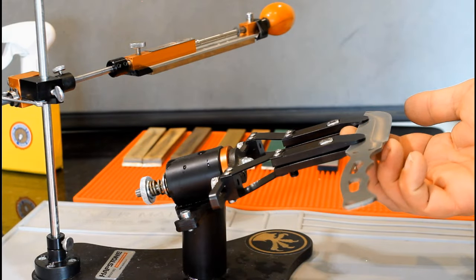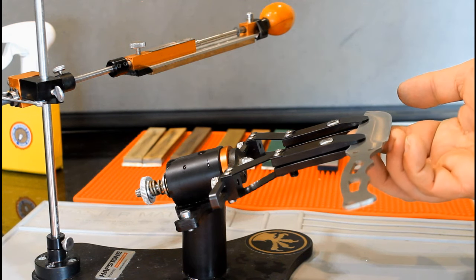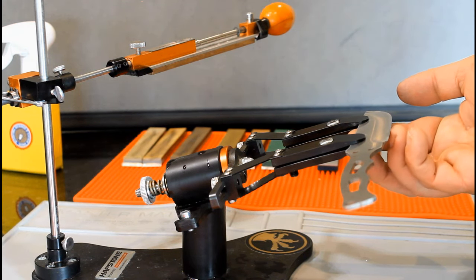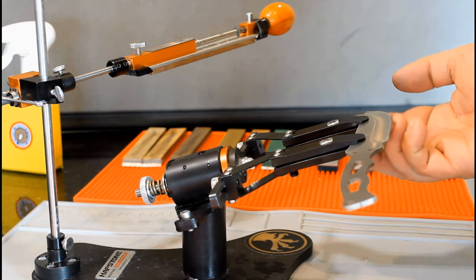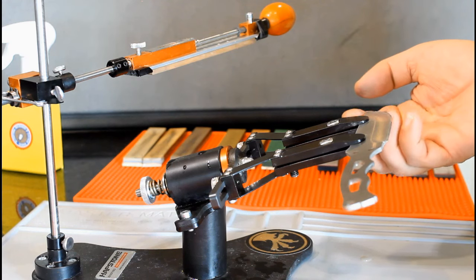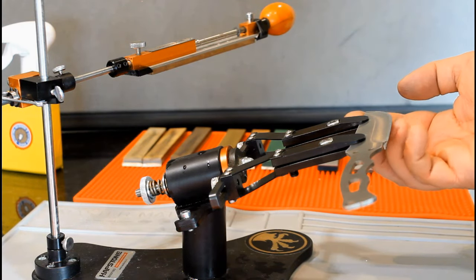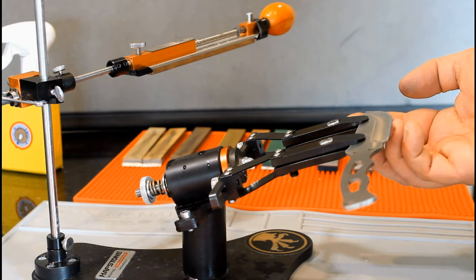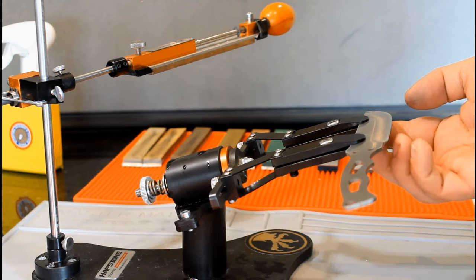All right, the burr is faint in the same place it was completely missing on the other side, but I can feel it. The burr does not need to be even in size. It doesn't matter if it is super noticeable at one place on the blade, and so small you can barely feel it on another. The burr just needs to be. If you can feel it along the entire edge of the blade, large or barely there, you are ready to move on.